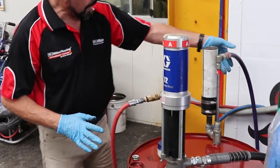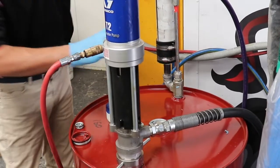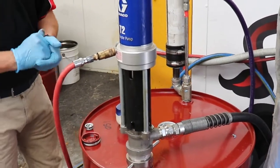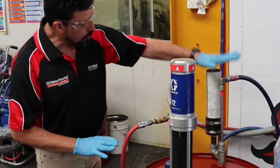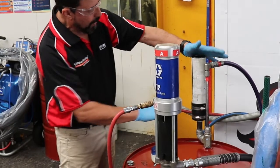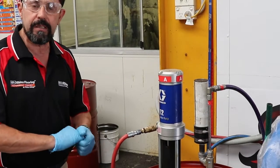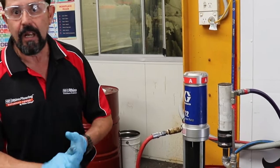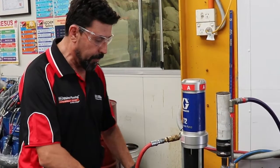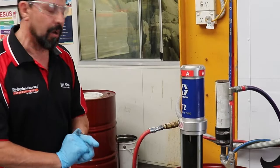We also want to grease our spear for our return line. There's grease on the lock nut here — we want plenty of grease so it's easy to come apart, but we also want to keep it airtight. On the drum we've got our air dryers: two canisters that sit at the top of the drum. We don't want any moisture getting into the iso, because if too much moisture gets in, when you go to spray you'll get pin holes and may even get blisters. So make sure all threads are sealed.